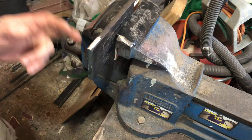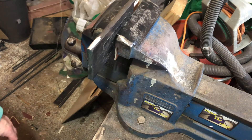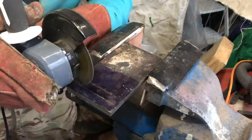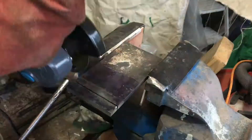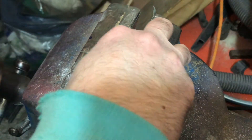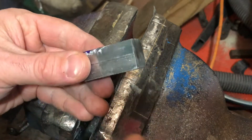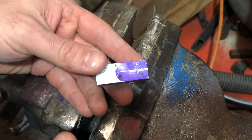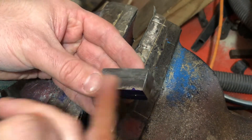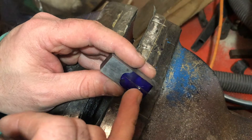I've got this bit of plate in here now and I'm just going to slice off a bit to create the clamps. I've cut the bit down the middle - you can see the join there - I've just super glued it together and squared it all up. I've also marked and centre-punched a clearance hole, so this will accept the arms.